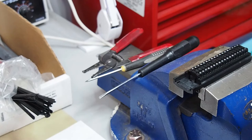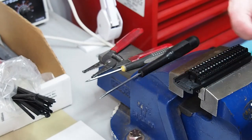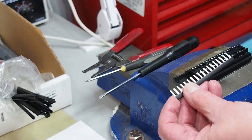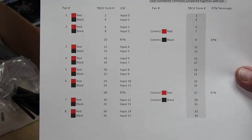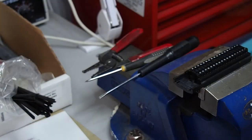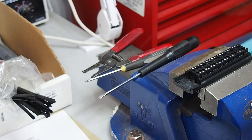Okay, we're back. Here's my setup for doing wiring arms. I've got a vise — just a standard 4-inch vise. Normally I have it pointed a different way, but for this demonstration I've repositioned it. Here's our Weidmuller jumper bar. I'm going to be doing this one up as a single-ended current wiring for a customer, using two-conductor, one-pair shielded cable. I've developed a wiring schedule for it.